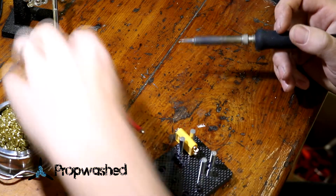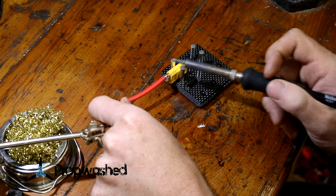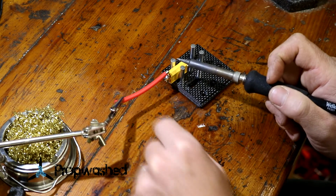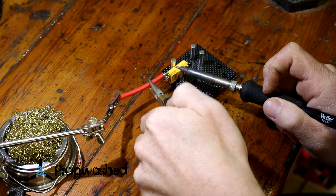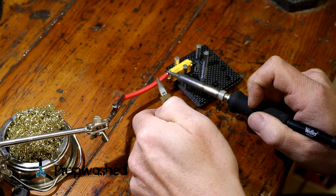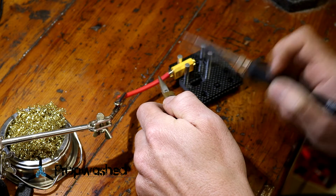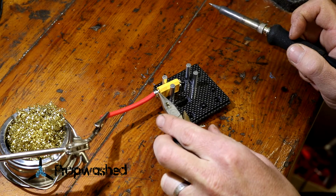Now that you've got that, you basically want to make them together. The wire gets very hot when you're working on it like this because you have to apply a large amount of heat. A lot of times I like to use short stubby needle nose pliers like this to hold it. You melt the wire first — remember you want to apply as little heat as possible on the connector. So you melt the wire first, then you seat it down on the connector and you watch. Eventually the solder on the connector will melt and secure, and what you're left with is a very even solder connection between the wire and the connector.